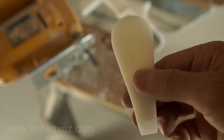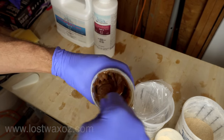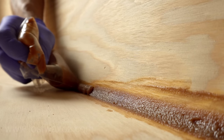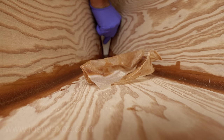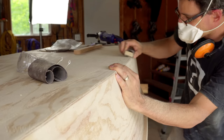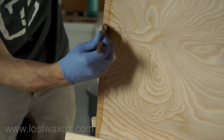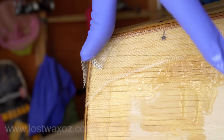I made a cool tool out of a plastic cutting board and made an epoxy and wood flour mix approximately the consistency of peanut butter — which I love to eat on toast, not the epoxy, the peanut butter. I put it in a ziplock bag, cut one corner off, and squeezed it out like icing. I used the round part of my special tool to make it all rounded and the flat edge to do up in the front. Once the epoxy had cured and was holding my canoe together I didn't need the tape or the zip ties anymore. I sanded the bottom flush with the sides and rounded off all the edges, painted some epoxy on all the edges, then laid down some fiberglass cloth on top of that, adding more epoxy with my paintbrush until I had enough to saturate the fabric and make it turn clear. A well-placed snip in the fabric and it folds down beautifully.